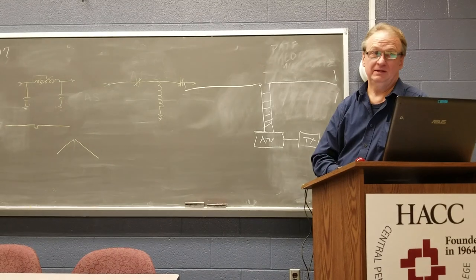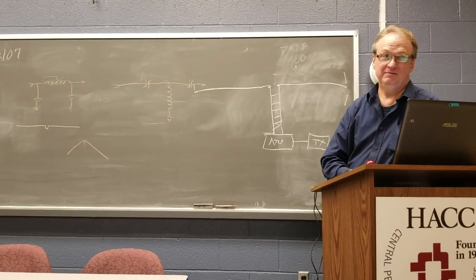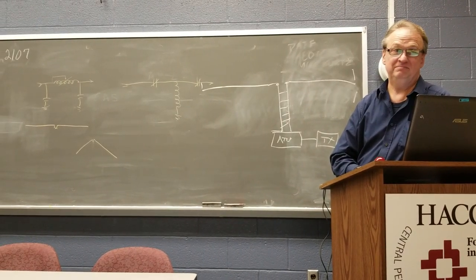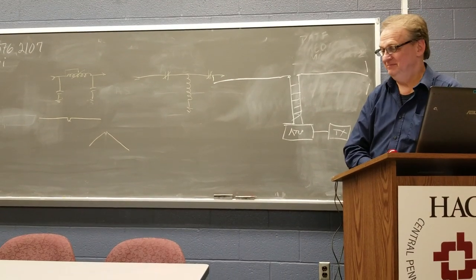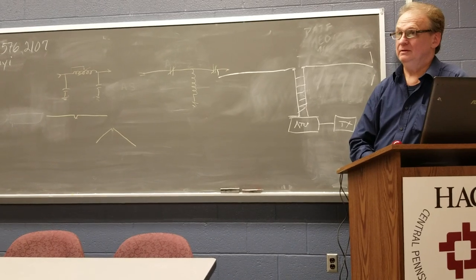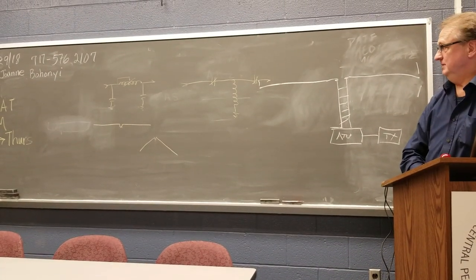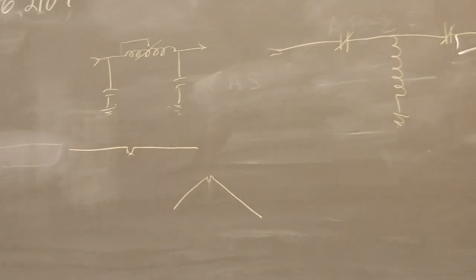Arc 5, the old Arc 5 transmitters. Boy, they have great roller inductors in there, man. I made many tuners out of those. Any condition. Arc 5s, I've torn them apart. Now I look back, I was ashamed tearing a transmitter like that apart, but I wanted that roller inductor. Terry, on that T there, you should show that inductor as being a roller inductor or as variable. Yeah. And that will tune anything to anything, that configuration.